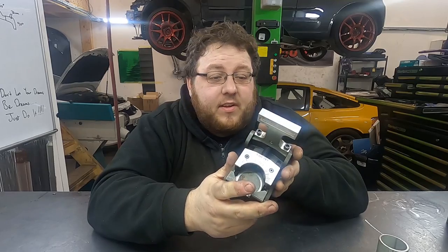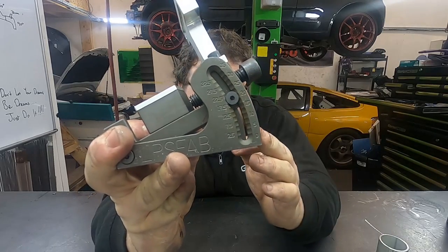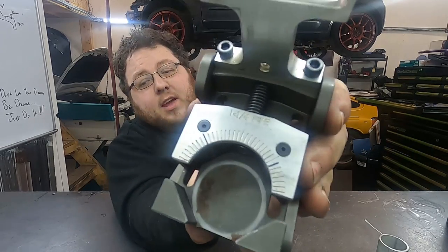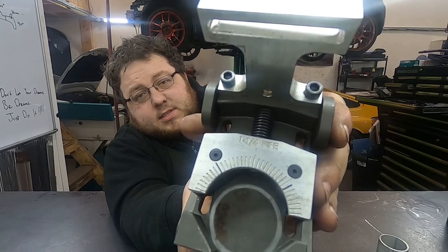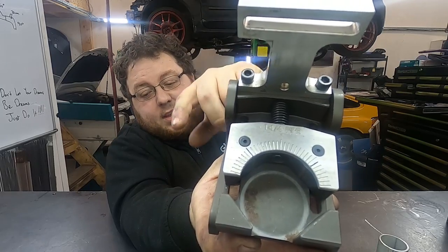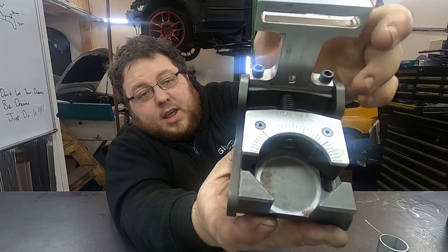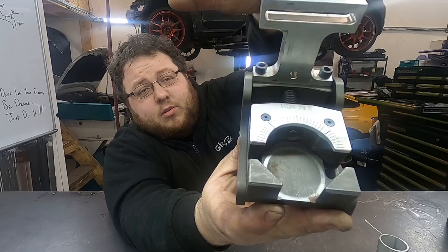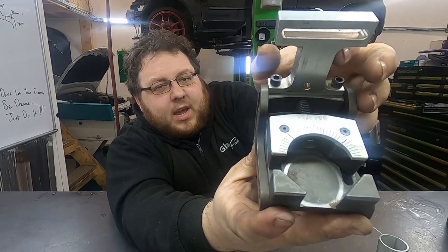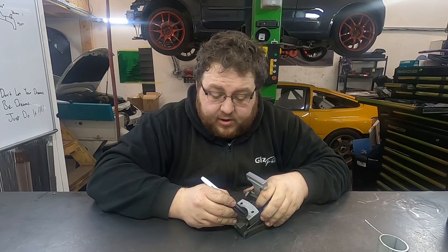This is the collector cutting fixture. You can see we've got degrees on the side so you can set the pitch angle of your collector — I've got mine set at 20 degrees. Around here you can see notches for your rotational cut. I've got marked 90 — or zero — on this side, and 95 on this side. The notches are in increments of five degrees, which is why it's a bit difficult to get exactly 97.